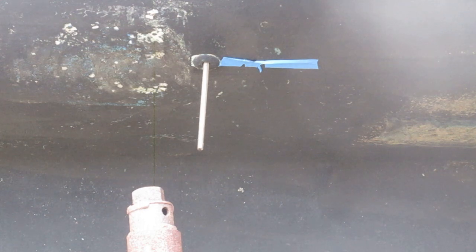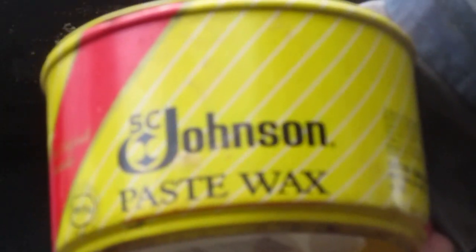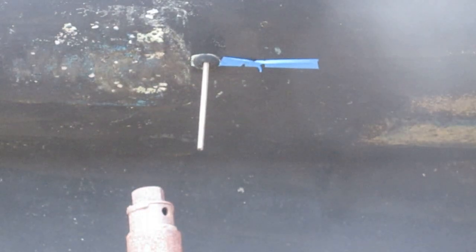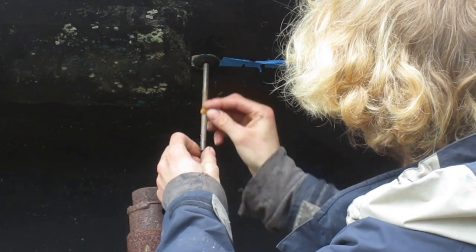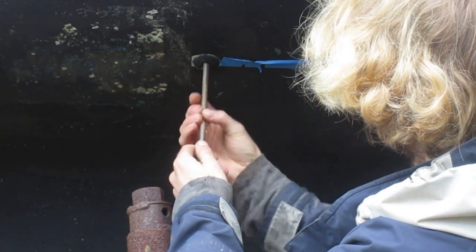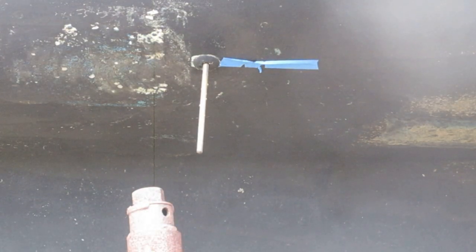Since I'm using a stainless steel all-thread and nut, I'm going to put a little bit of this floor polish paste on it just to lubricate it so it doesn't seize up on me. I've had stainless steel seize up on me before and it's not fun, so you want to make sure you lubricate them before tightening them down.